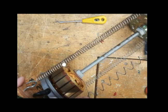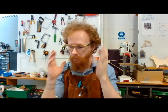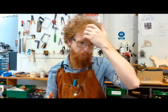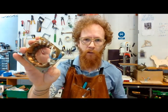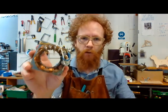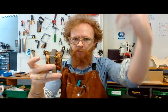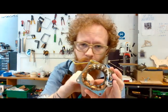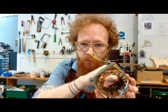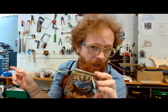So you can use coils as pickups. Where else can you find coils? Motors are a really good source — you can often find broken motors on broken appliances. This is one I use quite a lot: it's from an electric fan. The axle of the fan comes in there and the blades spin around. This one's quite interesting because it's a circle, so you could make an array of strings in a circle and that would work as a pickup — and here is an example of that.